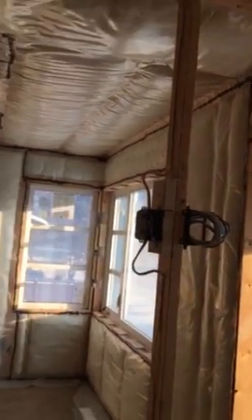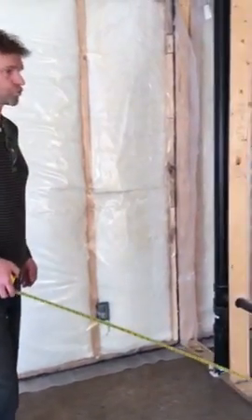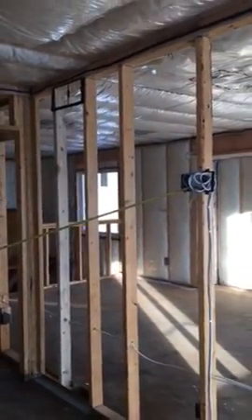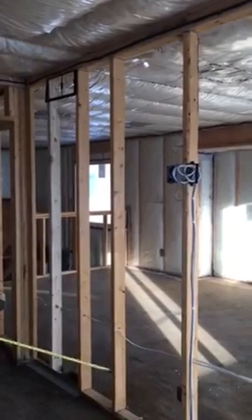In the bedroom, there's a power outlet to the bottom left of the window and a power outlet to the bottom right of the window. The closet has power outlets on either side of where the bed location would be. There is a TV and data location here, and backing should be put in here for that — I'll do that tomorrow.